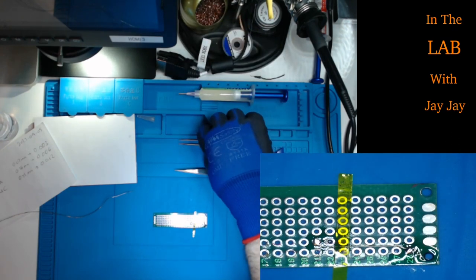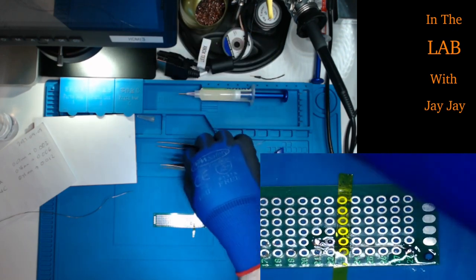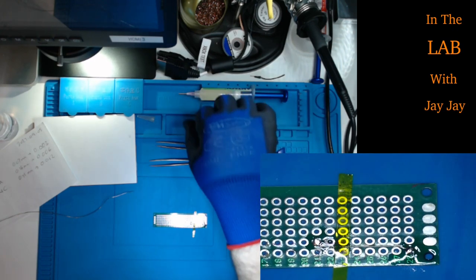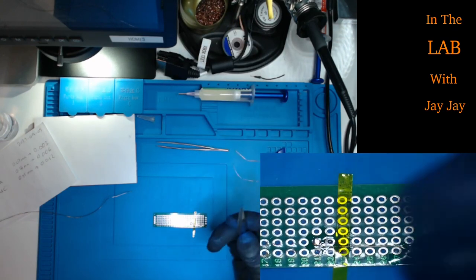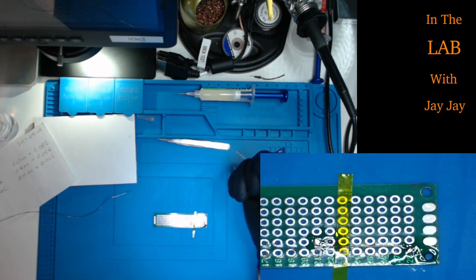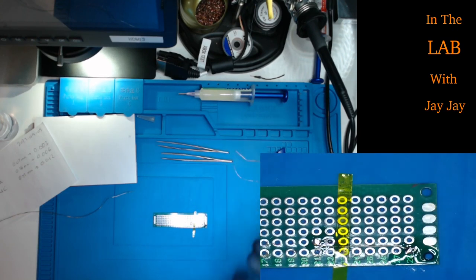I find that I do get a little bit of flux and gunk on my tweezers, and so I just hit them with the solder braid. You probably can't see that up the back of my bench. Maybe you can. Oh, yeah, you can. Okay, good. So take the tweezers, hit them in the solder braid, and it just takes the excess gunk off the top of them. I do believe they're non-magnetic, so they don't have magnetic or static or any of those sorts of problems. But if you get flux on there, you can make the tips a bit sticky.